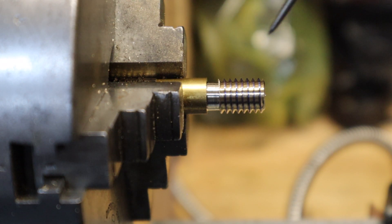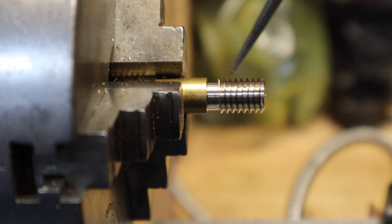I'm confident that without measuring, because I've done it to specification rather than doing it to fit, I'm confident that if I sent that thread halfway around the world it would fit what it's meant to fit. Usually if you're making a thread like this you don't always have the nut or socket to try the thread in, so you have to make it to specification. That's single point thread cutting to depth on the compound without doing any trigonometry — the compound is set at 29 degrees, or 29 and a half, but no more than 30 anyway. For a 60 degree thread, which is obviously what this is.